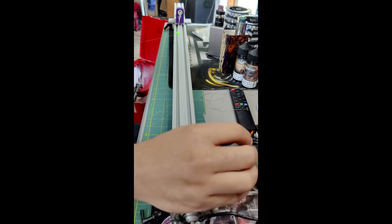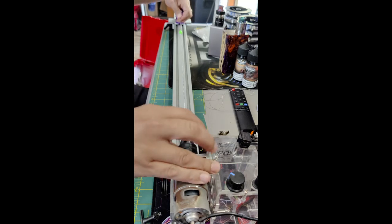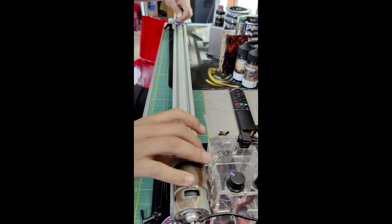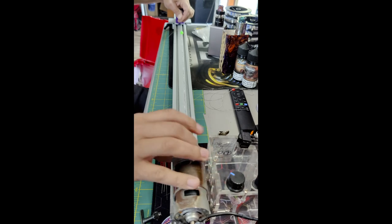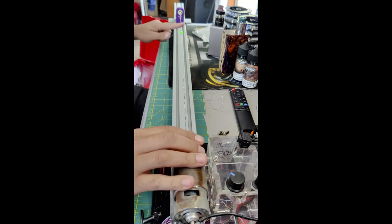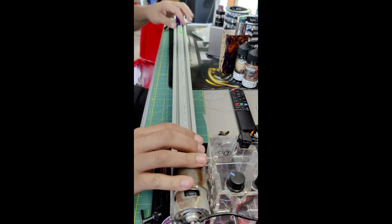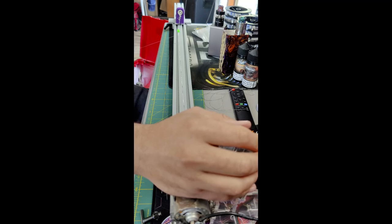So right now, we're starting to kind of bunch up, and it's an audible sound that you can hear from my perspective, not so much over there, but it'll start kind of jumping. And what we've got is one twist here and one twist here. I always end up with a slight amount of twist, and I think that's due to no stretch, just because we're putting a little more tension on the cores. But what you can do is hold your swivel and rotate your chuck. What that does is it takes the twist out of your wire. What you can also do is advance your core holder manually. You want to resume tension on your wire.